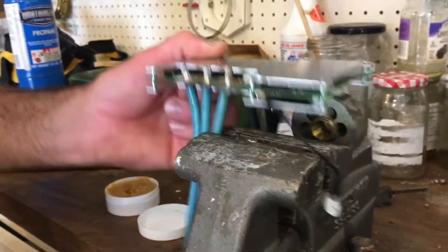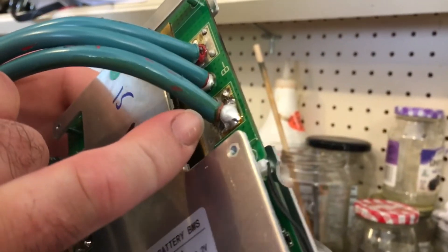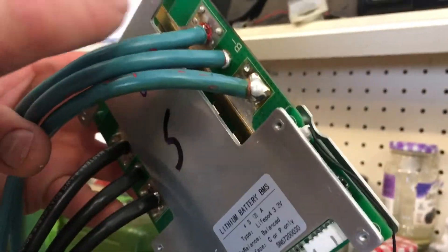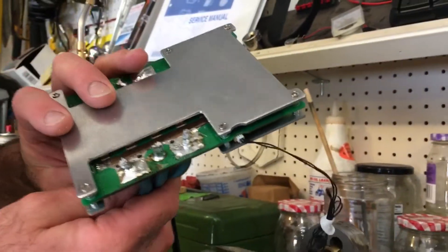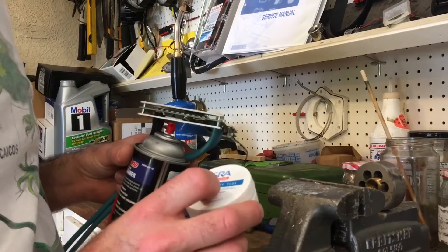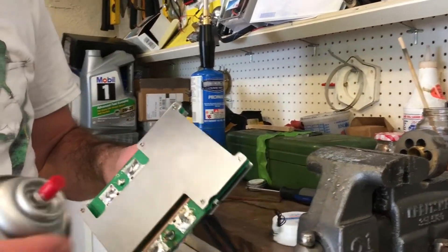So I can open up the vise now. You can see that for some reason on this last one the solder wanted to kind of drip out the bottom side, and that's okay — at least we know there's a lot on there. Unless you have no-clean flux, which I don't think this is, your flux is a little corrosive, so you need to rinse it off. I'm just going to use brake cleaner to clean it.